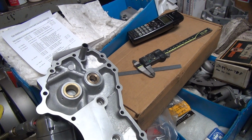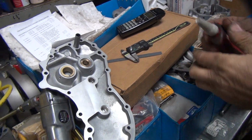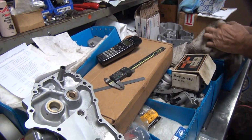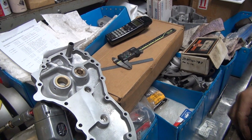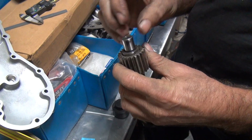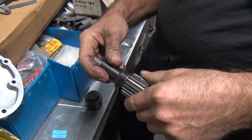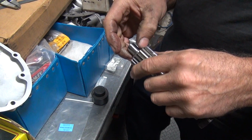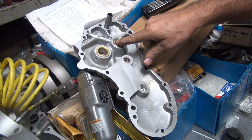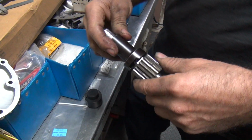Alright. Well, being at 43 is going to help us a lot because that leaves us 80, and about 76 thou difference. So hopefully we don't have to trim more than about 30 off of here to make it clear, which I can live with. We still have a good mate to get on there. I still got enough to torque it in without losing it. But I'm going to probably have to chamfer this hole right here a little bit, the edge, because the thread's going to get tight.